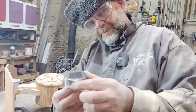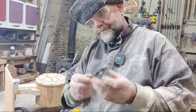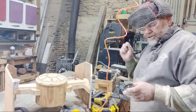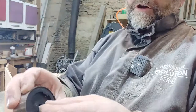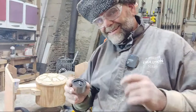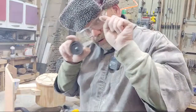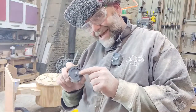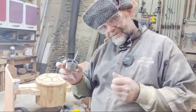So what I'll do is, this piece here will be mounted onto the letterbox, the gargoyle letterbox. And all I've got to do is use my soldering iron, which happens to be here, and solder a couple of flylead wires off the live and the neutral. With an LED, you've got to make sure you get it the right way round, because an LED effectively works like a valve. It's one way. Then I'll bond that into the eyeballs, and maybe put a little bit of red nail varnish on so they glow red. That's my idea anyway. The thing about these is they're ten a penny, and they're really cheap to replace.